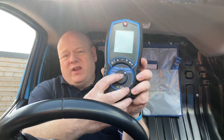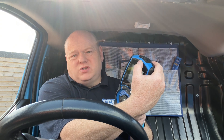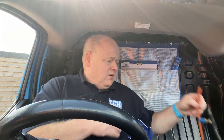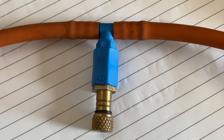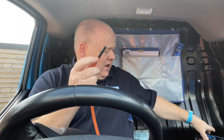On the selector dial you can just scroll straight around to Tests. When you do that, turn it on — there's a button on top to turn on — and it just takes 30 seconds, which is a lot quicker than it used to be. I've also got a little T-piece in my analyzer tube that lets you release a little bit of pressure if you put too much in. I'll try to find who makes it and put it in the description. On the end we put a connection that connects into the flue gas analyzer.